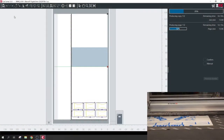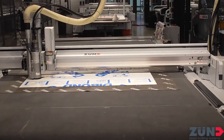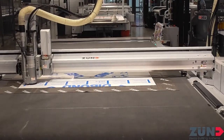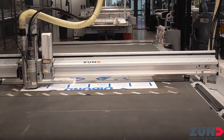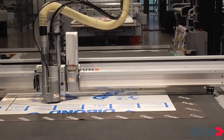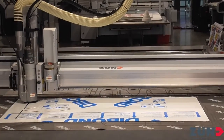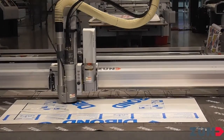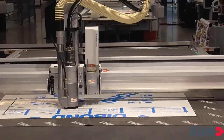The ITI is touchless. Compared to the S3 model which has automatic knife initialization, with this machine we can also initialize creasing wheels — a little bit better functionality and a little bit more automation. The bit we're going to be using right now is the R141, a form routing bit. We have many different form routing bits on our website.